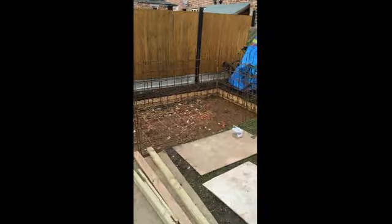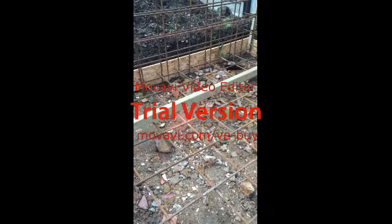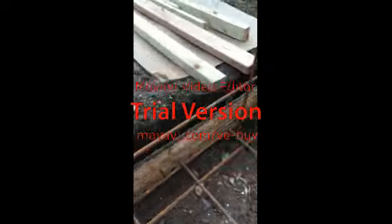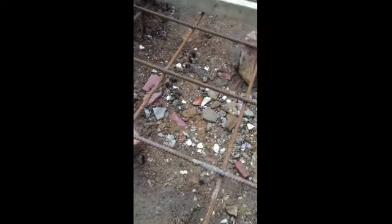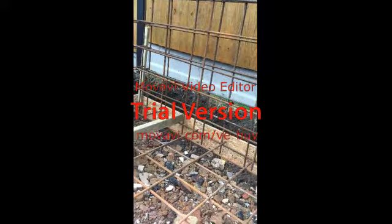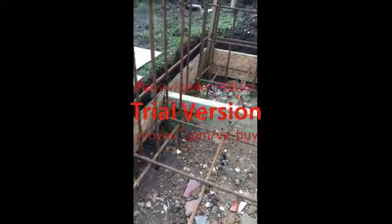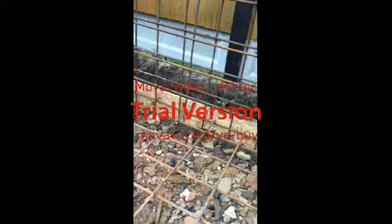So, as you can see, I built all the carcass from reinforcing bars. I used 12 mil, with a base 20 centimeters deep. I've done this plank all the way around, level. Then 20 centimeter gaps for the walls, 2 courses for the walls. For all this I used about 420 meters of reinforcing bars. In other words, I bought 70 pieces of 6 meter length. I tied them together like this, and today we'll do all the concrete base.